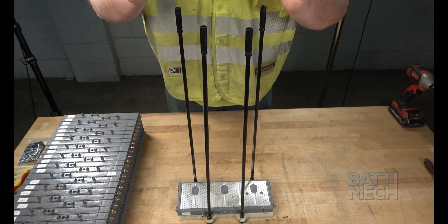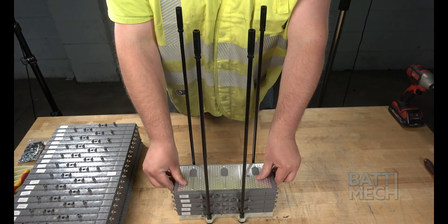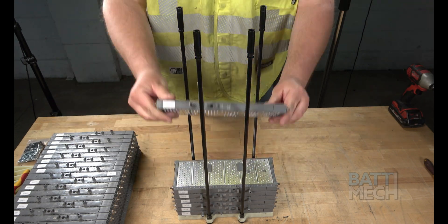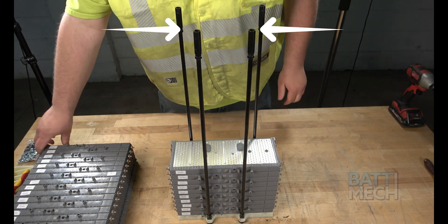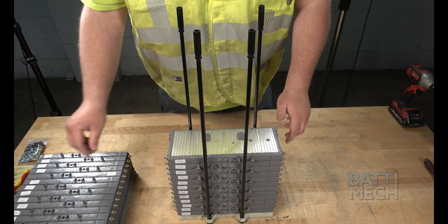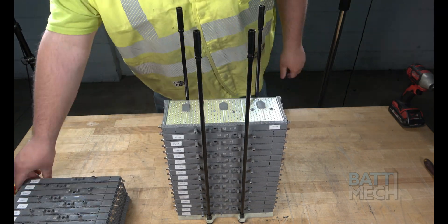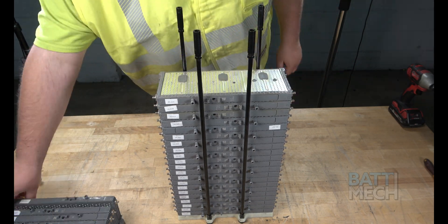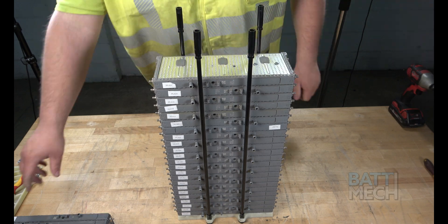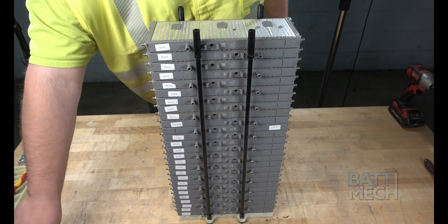Go ahead and stack the modules into the battery compression block. Note that the black buttons will remain at the bottom of your stack. The two wider posts should be in the front, facing toward you when you load the compression block. As you load the modules, the numbers should be upright and facing you. Number 1 will be inserted into the compression block first. Then, continue to stack modules sequentially up to number 28. When completed, the stack of modules should look like this.